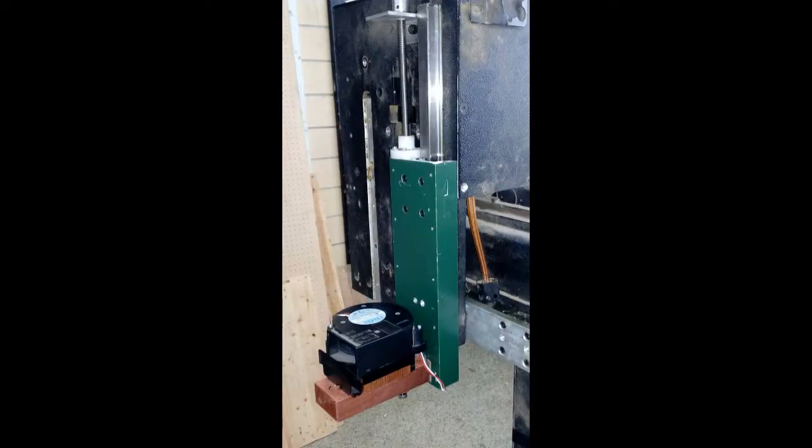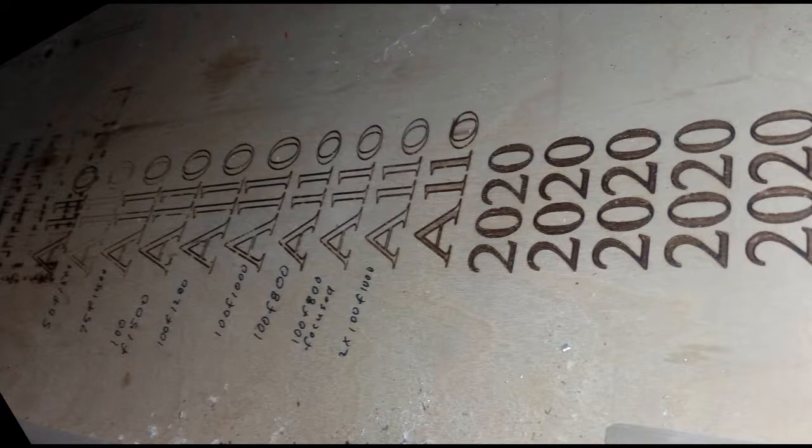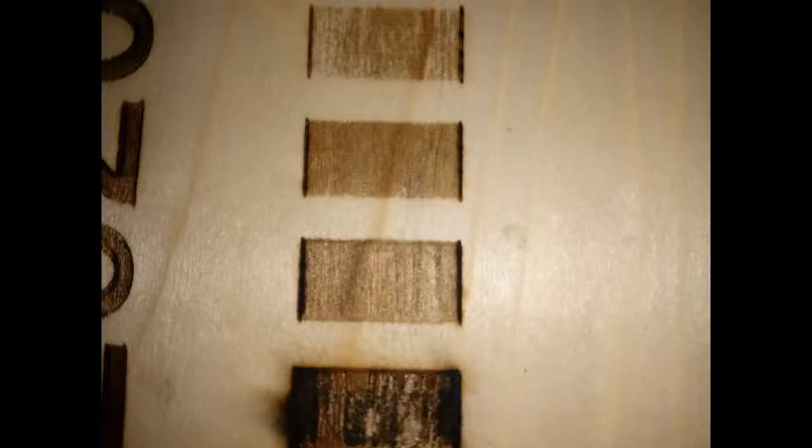Here's a picture of the laser mounted on the head — it's not wired yet. This shows the lowest position it goes. I bought two lenses for the laser: one is a G8 lens and the other is a G2. The G8 lens is more forgiving for focus but doesn't make as small a pin, hole, or burn as the G2. Either lens is okay depending on your needs.